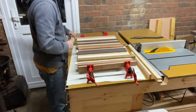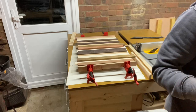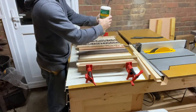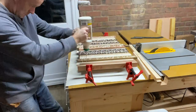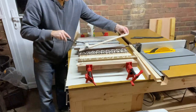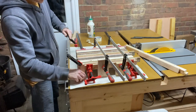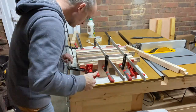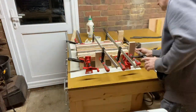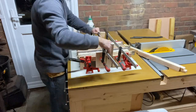Once they've all been done I can now get the first glue up done — quite a straightforward glue up. Just pop them all into the clamps in the right order, get out the Titebond III glue which is waterproof, and get gluing up. I like to use a nice little paint roller just to spread the glue around — just find it easier that way. Then start loading it up with clamps. Including the pipe clamps I'm using about five clamps in total, which pretty much covers the whole thing. Plenty of clamps whenever doing a glue up.